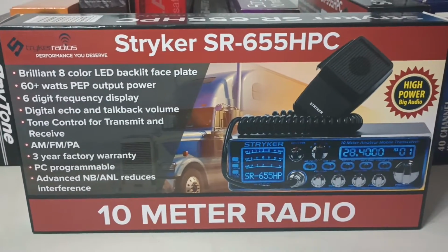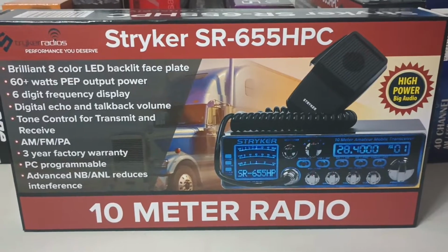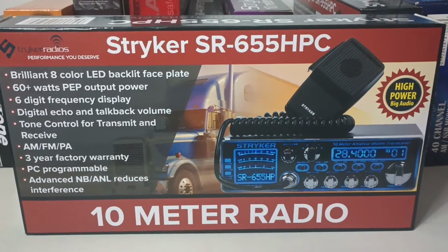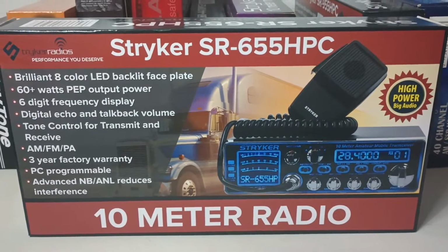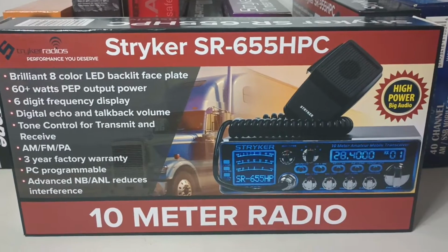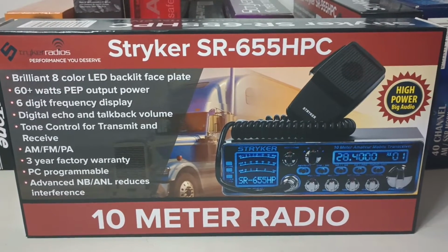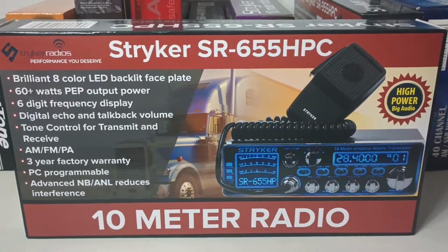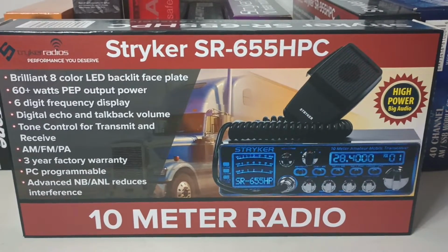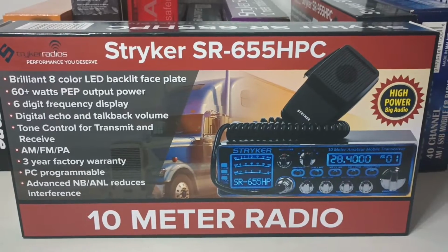You can still do the all the way mods to them. AM regulator, final, average power mod, and they're going to perform just like a 955. I think I've actually sold one of these, maybe one done all the way, but a lot of people like them just tuned and ready, and that's fine. You can drive them into a straight 4-pill, straight 6, 6-pill 454, 8-pill 454. If you get them done all the way, that's probably going to be a really good combination.